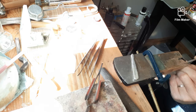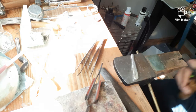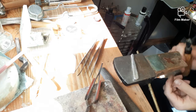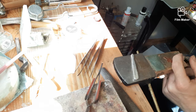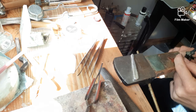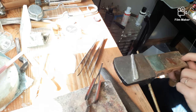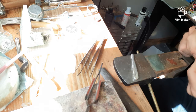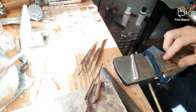There goes a chunk of skin. That's how easy it is doing this kind of work to hurt yourself. And with this little saw here, I got a little nub on both sides so I can get the blade in the middle. If you cut through your material, you can't catch the blade in time, and if your finger is just slightly in this nook here and you touch it while it's moving, it'll cut half an inch into your finger. It does not feel good.